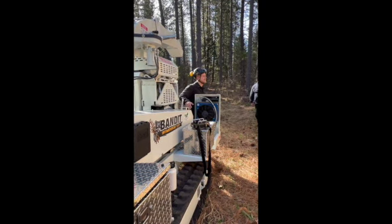Perfect. Moving on to the discharge, guys, you are completely hydraulic. Again, it's on the remote. You do have a transport locking pin here. When that pin is locked up, it's just going to prevent that chute from moving. The idea is when you're towing it down the road on the trailer, it's going to lock that up so that discharge doesn't spin around on you. You've got a hydraulic motor, so that's not going to happen, but that's what that pin is for, just so you guys are aware. You do have a height adjustable discharge chute, so you raise this jack up.